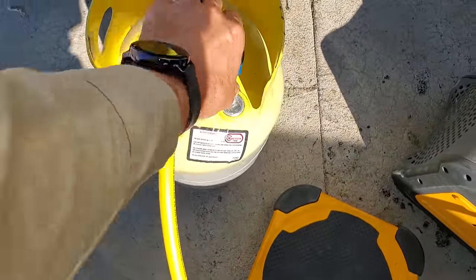So let's move this over just a little bit better, and we're gonna go ahead and hit start. It's in recovery mode. We're running. Watch your discharge pressure coming out of the machine. If you start to notice really high discharge pressure, you can always dip your cylinder in an ice bath. Removing the Schraders and stuff is really gonna help out because it eases restrictions. But all right, we're gonna let this guy run.